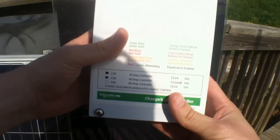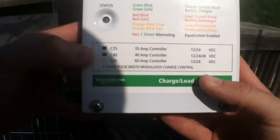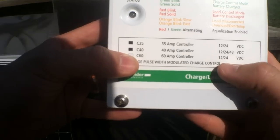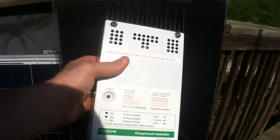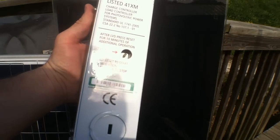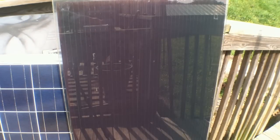Now with all that said, a great charge controller in my opinion is Xantrex. They make this in different style models: there's the 35 if you're only using 35 amp; there is the C40 that is good for 12 volt, 24, or 48 volt, so if you're not going over 40 amp; and the C60 is great for preppers that want to be in the 12 or 24 volt range because it's 60 amp. It has a good heat dissipator, auto reset button, and is very simplistic — just four screw terminals inside. It's very useful for using one of these type panels.